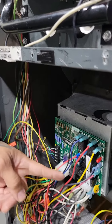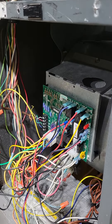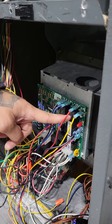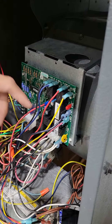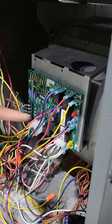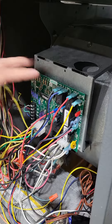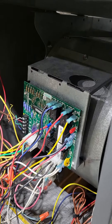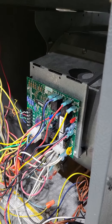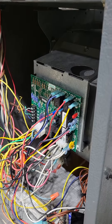These individual relays — yes, you can find them and yes, you can replace them — but the time and cost to replace one relay doesn't make sense compared to just replacing the entire board. Because if you replace one relay, that board is still used, and there's no warranty on the rest of it. If it fails again, the customer's going to ask why you didn't just fix it from the beginning. It's hard to get paid on things and hard to have the customer accept those repairs if you don't give them a reasonable or understandable explanation.